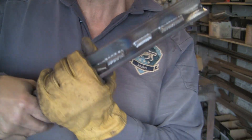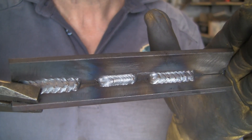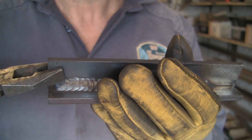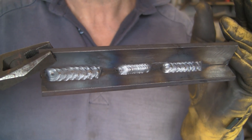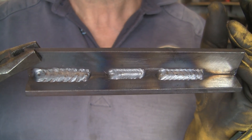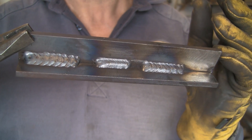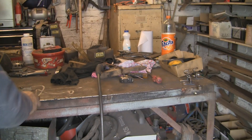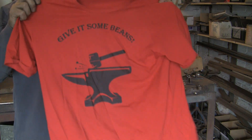That's why it's really difficult for me to suggest settings — there are so many variables, and you can see I've just altered one thing and that makes so much difference. By the way, I'm using 0.8mm wire. I used to use 1mm all the time, but I realized I was doing more smaller jobs on 16-gauge up to 3 or 4mm than I was doing 4mm up to 10 or 12mm, so it's pointless having a big wire especially for fiddly jobs.